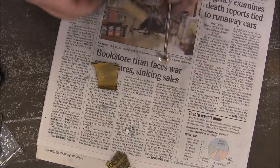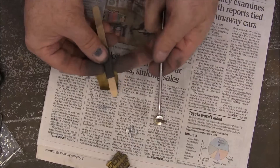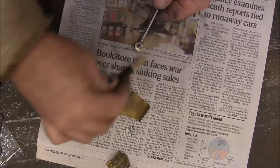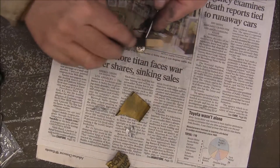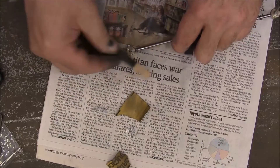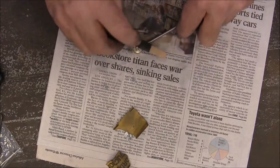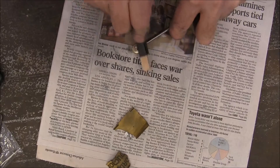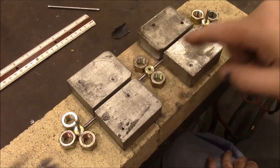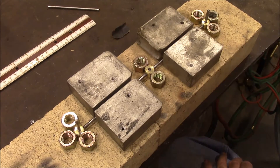It's been about 15 minutes and I gave up on those buffs and started using some 320 sandpaper wrapped around a popsicle stick, and that is working really well — it's cutting this and roughing up the finish on the brass, but I can come back and sand that back up. I've been using 600, then 1000, then 1200, then buffing with some red rouge. So I got this thing completely finished, buffed out, solder removed, everything — and then realized I had made it too short.